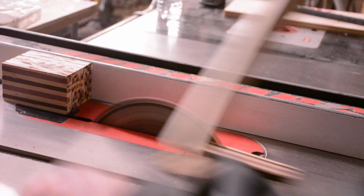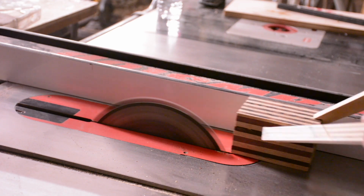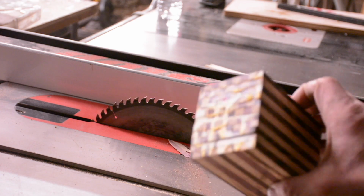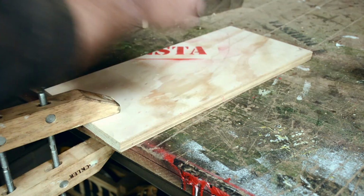And so that's one way to use your clamps as a vise. And now once I got one smooth side, again I'm just using the table saw as a joiner. Pivoting off that one smooth side that I did with the low angle block plane there, and I get all my sides square. And it actually was quite square. And now I'm just cleaning up the edges, and there's my chunk.